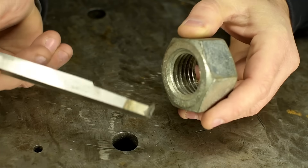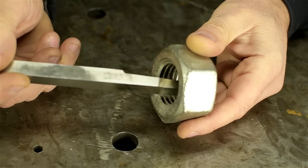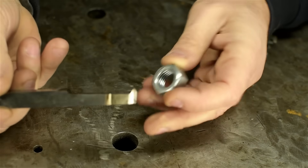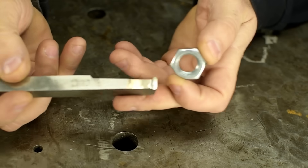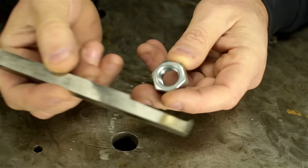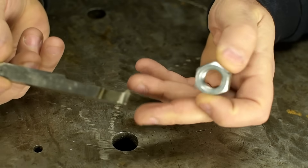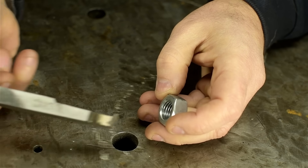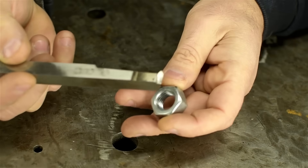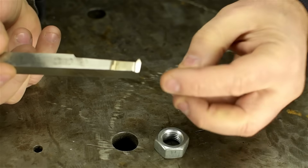Here's where things get potentially tricky. If the part is big — bigger than your turning tool — you're golden. You just need to grind the shape of the thread, give it some relief, all the standard fare, and you're on your way. But as the bores get smaller, it starts getting harder and harder to breathe. Obviously you'll need a smaller tool. Not only do you need all the same clearance and rake and all around that cutting tip, but you're also going to need clearance for the tool itself — clearance to get into and move around the hole. Nine times out of eight, you're probably going to be working with a square tool blank and making round threaded holes. You'll end up grinding all the corners off your tool and more than likely thinning the whole thing out front to back. You need space to move your tool out of the threads and retract to come back out and adjust for the next pass. The smaller the bore, the more the fact that it's circular is going to start to screw with your tool. You'll find yourself grinding everything away, and according to science, the more you take off, the weaker the tool becomes.